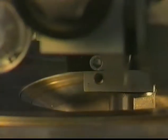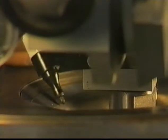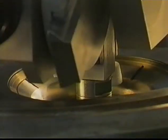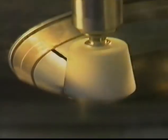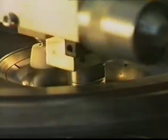If the surface seems completely smooth, bring four marks on the surface with a felt marker. The last time, always grind from the inside to the outside without giving a further feed down. If an extra fine surface is required, a little oil can be dropped onto the seat surface. Oil from the oil mist lubricator unit also gives the same result. Apply a little drop of oil on the valve seat surface. If the felt pen marks are completely removed, the surface is correct.